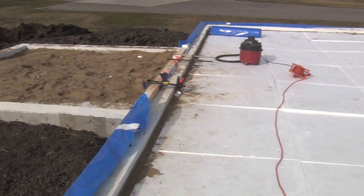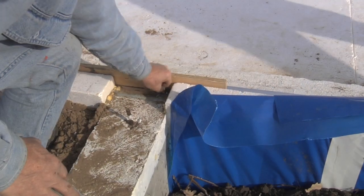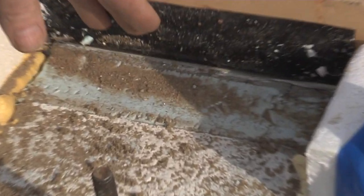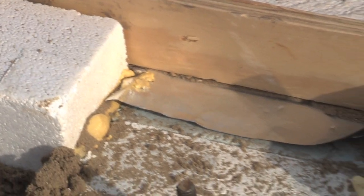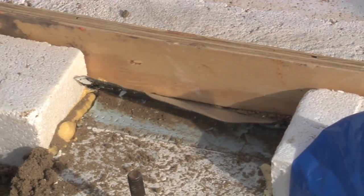This structure out here is a three-season porch and it's unheated. So we have a thermal break — two inches of high-density foam — so we're not transferring energy from inside the house to an unheated space. This is a common error we see in a lot of structures: they don't put thermal breaks in.